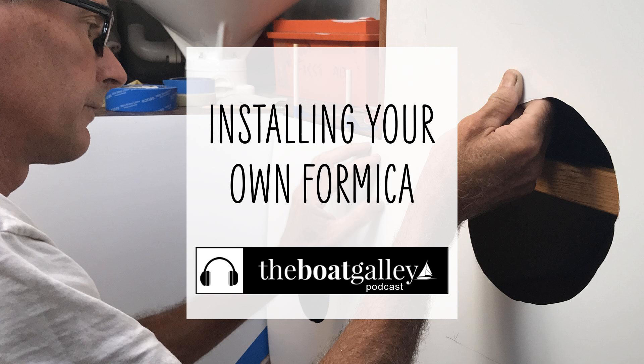Once those two surfaces touch each other with the dowels out, there is no going back. Make sure you have the edges lined up just the way you want them. Then using the laminate roller — which is a weighted roller — press hard on the surface of the Formica over and over again. As you start pressing, you will hear air bubbles being pressed out. That roller takes a lot of force; you're pressing with all your might and all your weight.